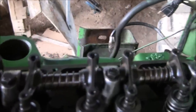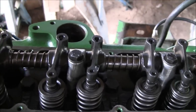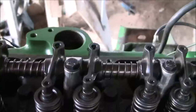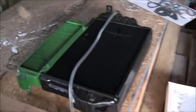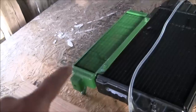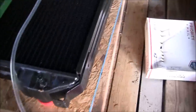This particular John Deere diesel has kind of a built-in intake manifold. It just has a pipe coming in and the manifold is integrated into the cylinder head. I'm going to have a brand new radiator for it — the old one was shot, confirmed at a radiator service. So I ordered a brand new one, repainted and reattached the oil cooler to the side of it.